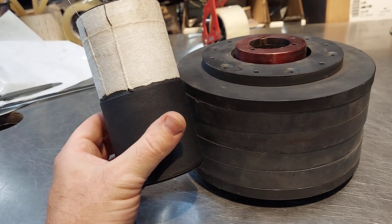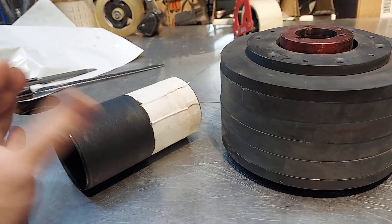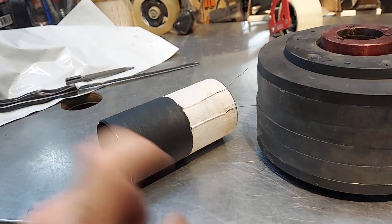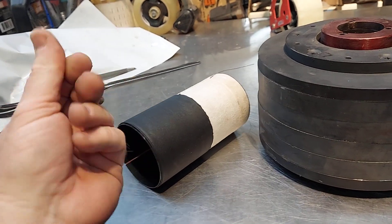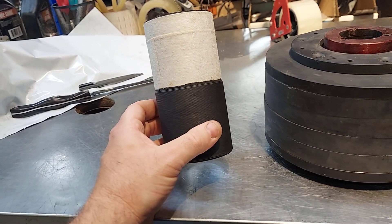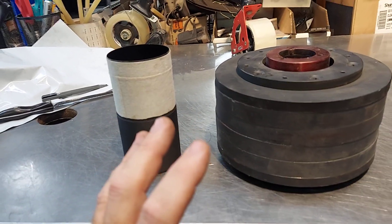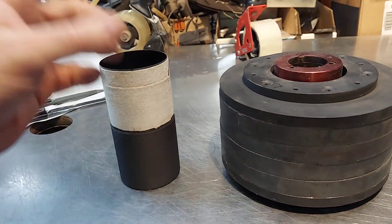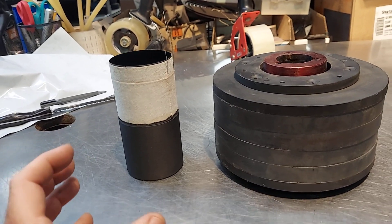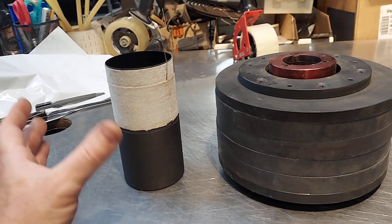All coils are rated the same way: by temperature, which is about 500°F — that's it. When coils are manufactured there are two ways to bake them. Sometimes the coating is just spray paint. Other times it is a proper black coating. There are two baking methods: one is an autoclave, a precision oven; the other is hooking them up in series-parallel to a circuit, getting them hot, and controlling voltage to set the bake temperature. It's cheaper, takes less space, but uses more electricity.